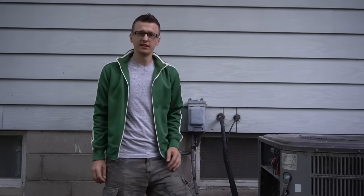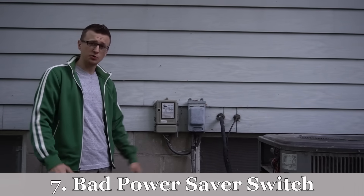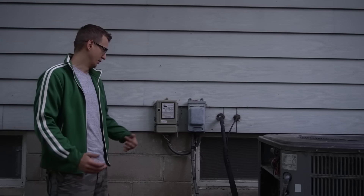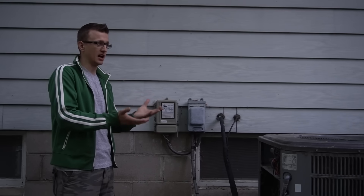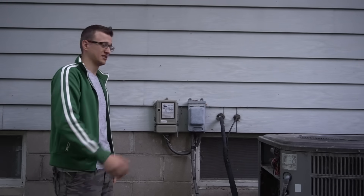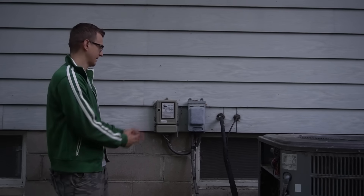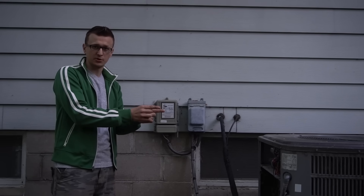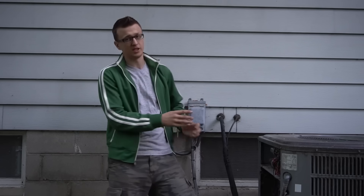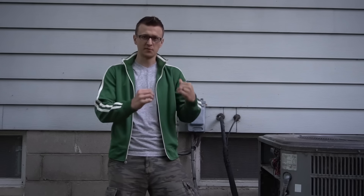Reason number seven is a bad power saver switch — generally located near the disconnect. Not all houses have this. On hot days, the electric company uses it to cycle AC units on and off sporadically so not everyone runs their AC simultaneously, giving you about $10–$15 off a month. But sometimes it becomes defective — power goes into it but never comes back out to your contactor. I have a video specifically on the power saver switch showing how to bypass it to test, then you call the electric company to fix their box.